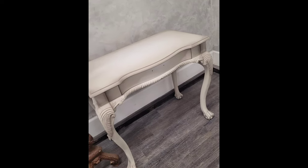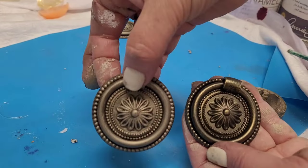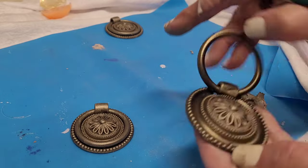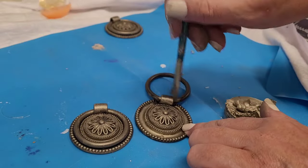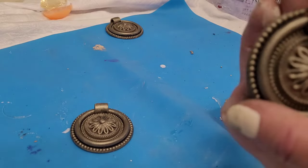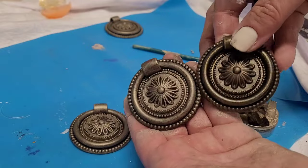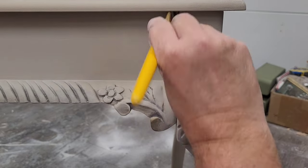Because I'm working with a designer, I need to get their seal of approval before moving on, so I sent photos of the finished paint to get their approval. Now let's pay attention to the hardware. The hardware arrived in an original bronze finish — while it was beautiful, it doesn't match the metal details going to be used in the room. The designer told me they're using white gold on some lamps and bed legs, so I want my hardware to match. I'm using Redesign with Prima décor wax in a white gold color, applied over the original bronze finish after a thorough cleaning, then coated in clear lacquer to protect the wax.